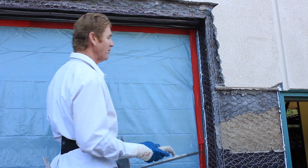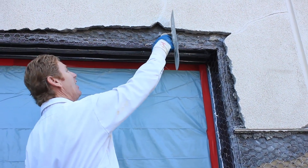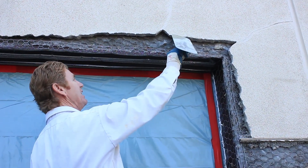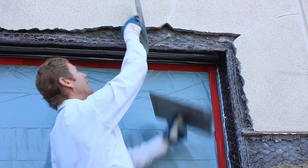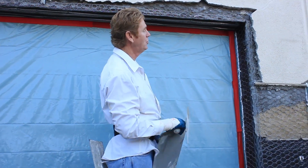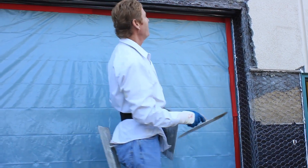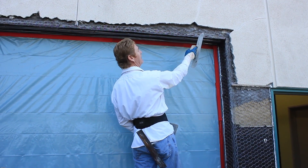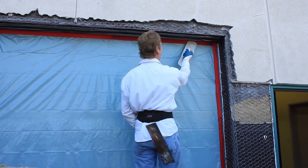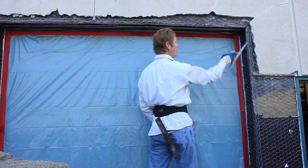What we've got here is some fancy lath. The detail here is two and a half inches thick right here, so the corner aid here has to match — everything has got to align properly. The fellas who did this were top-of-the-line lathers, never seen any better. We had a big challenge to get this two and a half inches thick, and make it where the seven-eighths surround J-trim or stucco stop matches these corners.